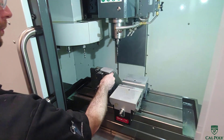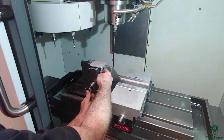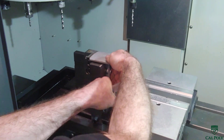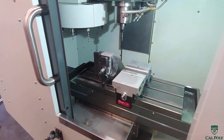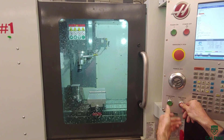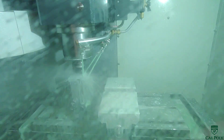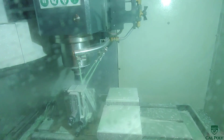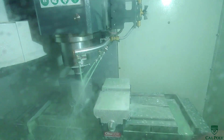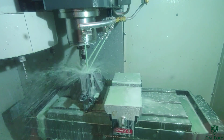Once I'm ready to go, I get in front of CNC mini mill number one and place the frame in the fixture to face mill the top of the part. I use the 7/8 box wrench to tighten the part down. Once the part is tight, I verify that the surface looks flat and that the correct CNC program is loaded in the control. I hit the green cycle start button and the two-inch face mill comes down and faces the bottom surface of the frame flat, removing all the draft surfaces so the frame can sit on the wood base without rocking. Then we drill the .257 holes in the bottom of the frame for the wood screws to mount it to the wood base.